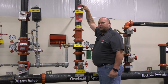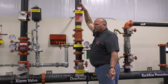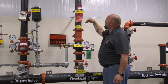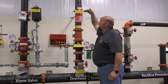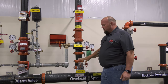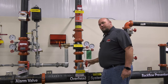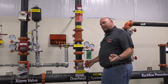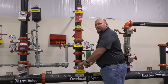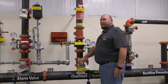You have a water flow switch. This switch activates the fire alarm system and lets everybody know that a sprinkler head broke or there's a fire in the building. If a sprinkler head breaks due to a fire, water will flow and there's a flapper in here that opens up and lets this switch send the signal to the bell. The other alarm switch is the tamper switch, which is in the control valve. As soon as you turn the valve two turns, you can hear the fire alarm go off — that lets somebody know that somebody has tampered with the valve or closed it. As soon as it is opened back up, the alarm goes back to normal.